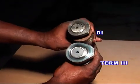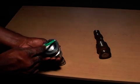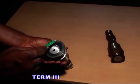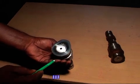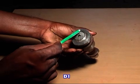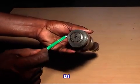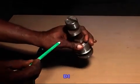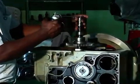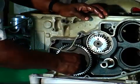The camshaft of DI and Term 3 are different. The only difference between the two is in the profile of the FI pump lobe. In Term 3 it looks like an egg shape and DI looks like a mango shape. Also note that the lobe of the Term 3 is slightly smaller in size in comparison with DI. Then clean the camshaft sub-assembly and fit it after proper oiling.